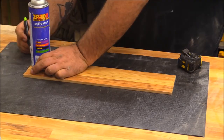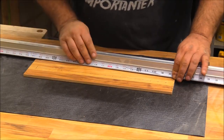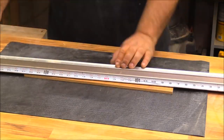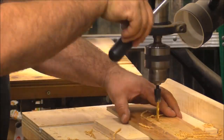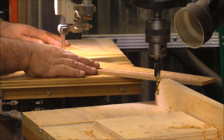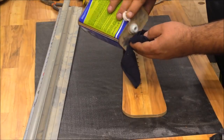I drew a line down the center of the plate and marked out hole positions about every one inch all the way down, leaving about six inches at the end. Then I rounded over the sides using a can to mark out the corners and a straight edge to create a little taper, and I cut that on the bandsaw. After drilling all the holes I finished the profiling on the bandsaw and cleaned everything up with a sander.